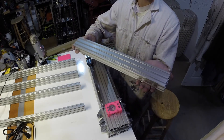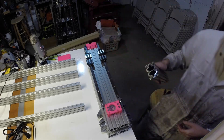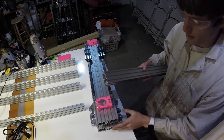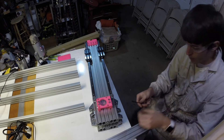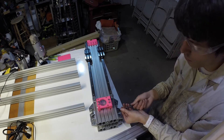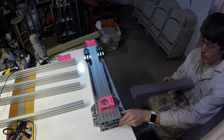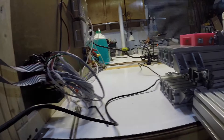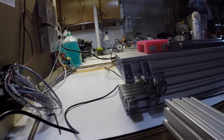Now we're going to take our back end cap rail — 40 by 60 by 505 — and slide it into every single one of these brackets at the same time. It'll be a little tricky; we're going to have to get these all lined up and leave all of them loose. We'll just slide this in, making sure these pieces are down and spread out with the top and the bottom.